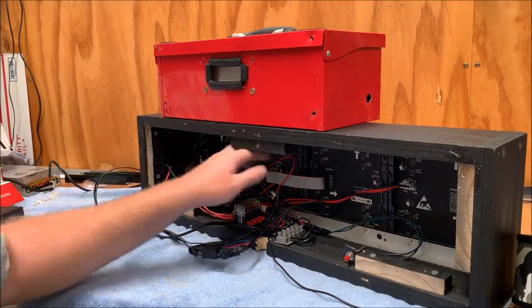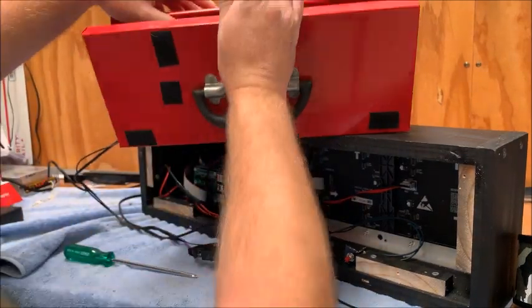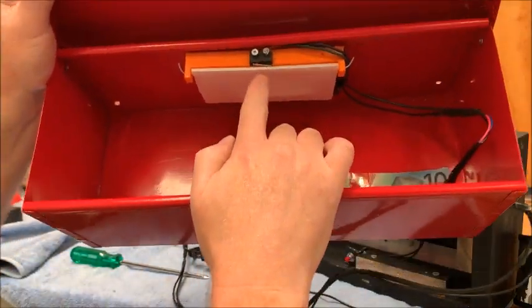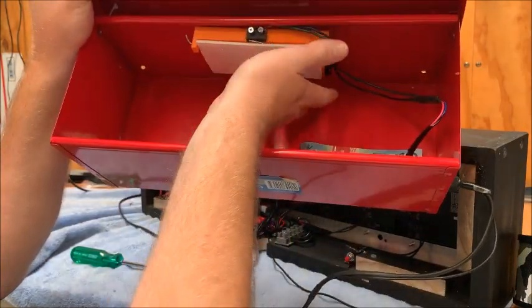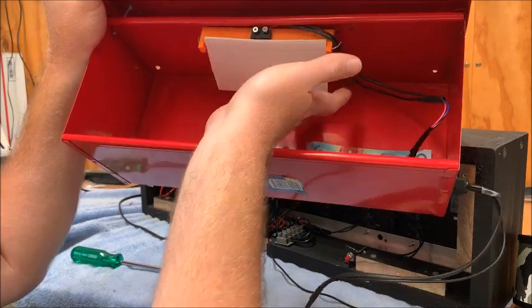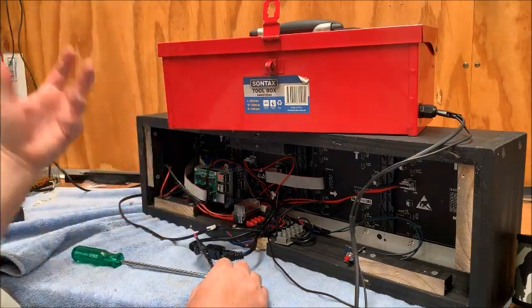The data goes out to the P5 panels. The way I'm triggering it in the donation box — hopefully you can see this down here — it's really basic. There's just a little micro switch. I made a little bracket and used a Coro flap for flexibility. It's a really simple hinge — just a piece of wire through the Coro — and that works really well for triggering the micro switch when people make a donation.